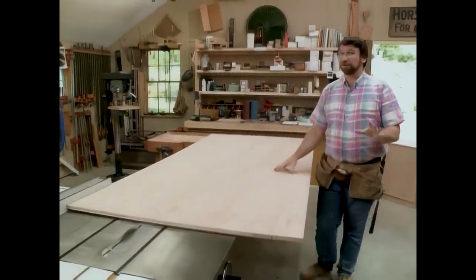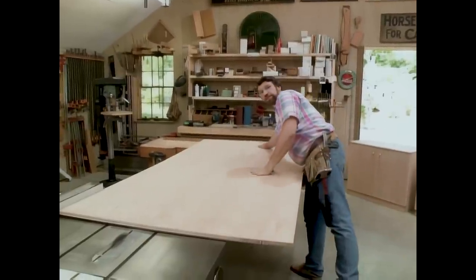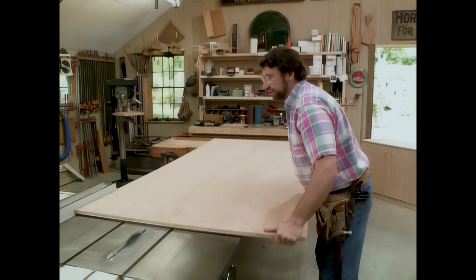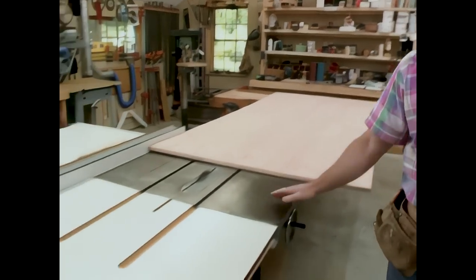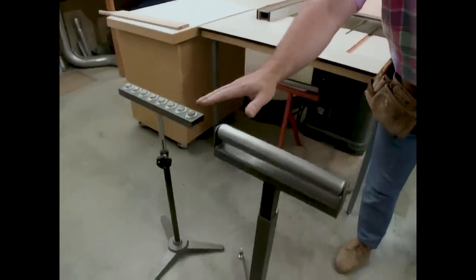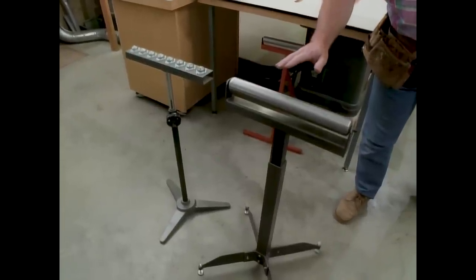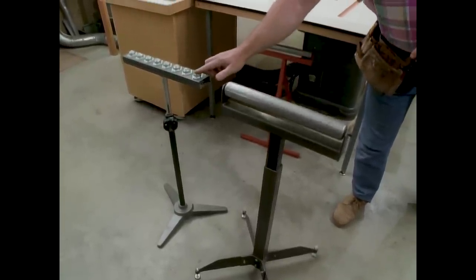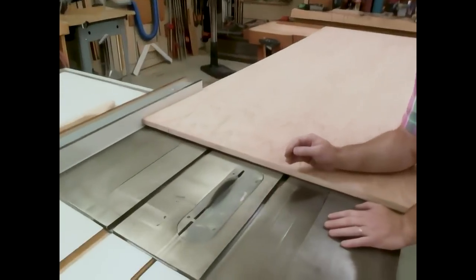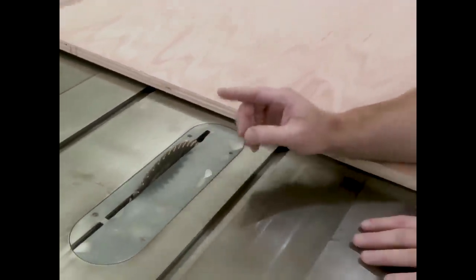Handling plywood in the workshop alone is not easy, so I've done a couple things that help. First, I set my workbench so that it's not more than eight feet from the saw, so that I can rest the piece as I set it all up. Now, I do have an outfeed table, but that's not enough because the sheet is going to go way out over the end. So I need rollers. These are indispensable — it's like a second set of hands. You can get a regular roller or a ball bearing type. The other critical thing to have is a very sharp blade whenever you cut veneers. This is a 60-tooth carbide-tipped blade, and it's very sharp.